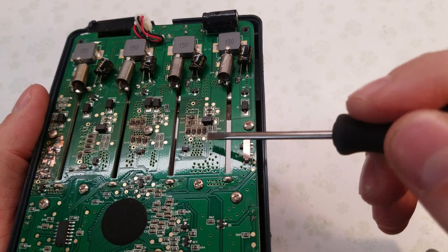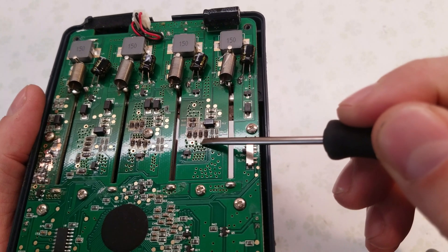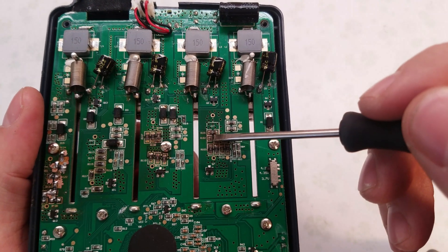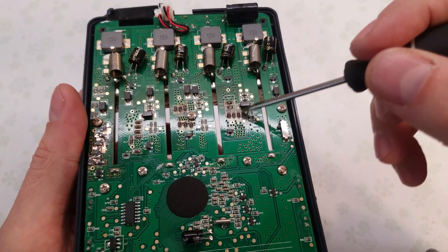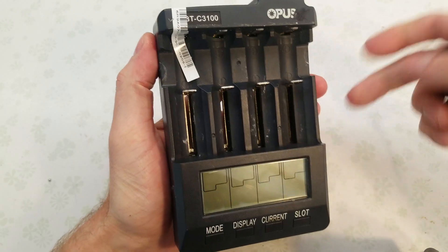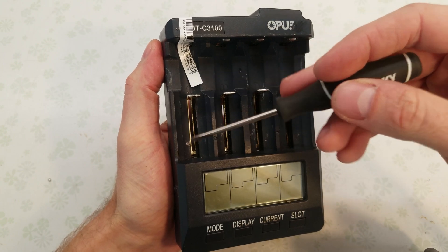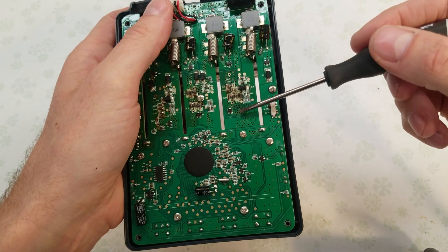You're probably not going to be able to see it on camera, but if you look at some of these other ones, the solder joints just don't have much solder in there. With the heat these are generating, if it gets hot enough they can easily come loose through melting that solder or just crumbling. And it's not just the heat generated by these resistors — sometimes you'll get a cell that gets hot while charging, specifically the Sanyo cells are known for that. When that cell is in the charger before you notice it's hot and remove it, that heat is dissipating somewhere, whether up through the air or down into this board.